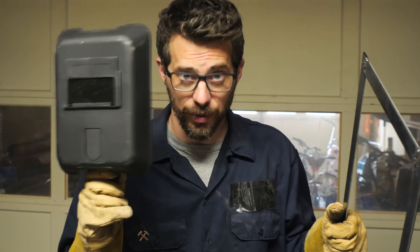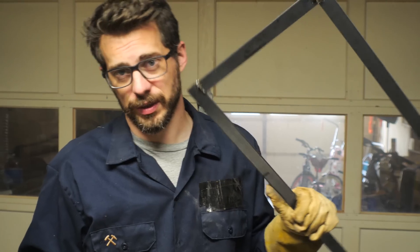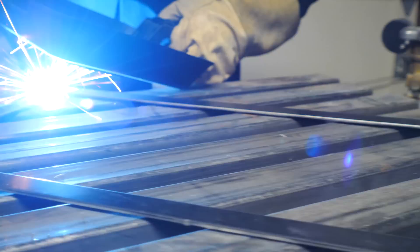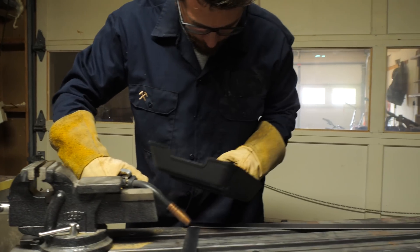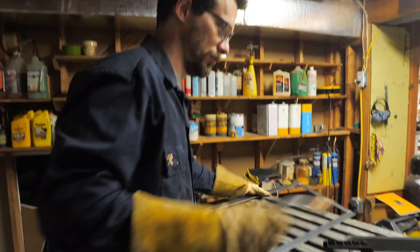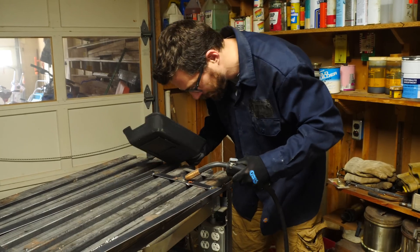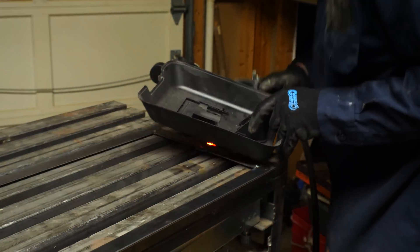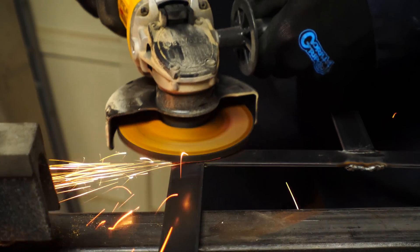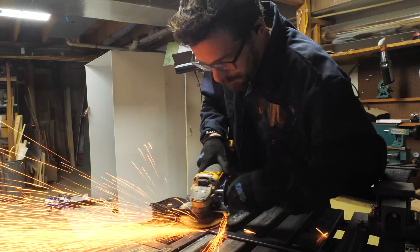The battery in my welding helmet died — there's a battery that makes the glass auto-darken when the flash comes from the arc, and that died so it doesn't really work. So I'm having to use an old-school cover which makes it almost impossible to see what I'm doing. This would not be a good welding job for most other purposes, but all this has to do is hold a really thin sheet of plastic. I finished up making a second frame that matched the first one and then laid on some pieces to act as handles — these are on the top frame and they do overlap, but they're not going to be in the way of anything. After I got all the pieces welded together I went back with a grinding disc to smooth out all the welds. It really only matters that they're smooth on the bottom frame and on the bottom of the top frame — you want to make sure that these pieces are sitting as close together as possible and sit flush against the top of the vacuum box.